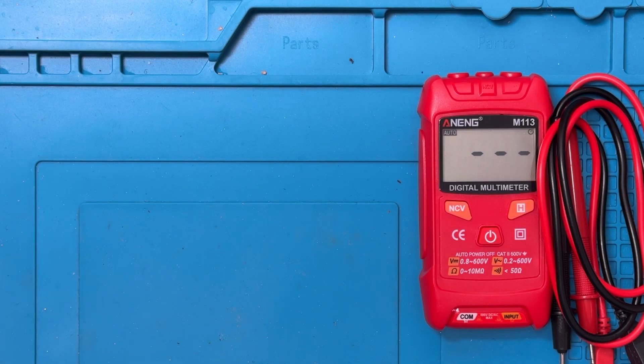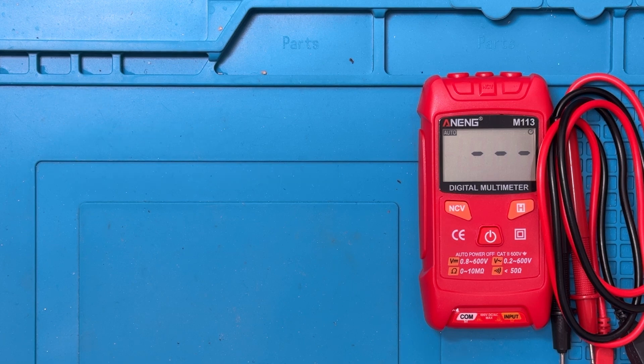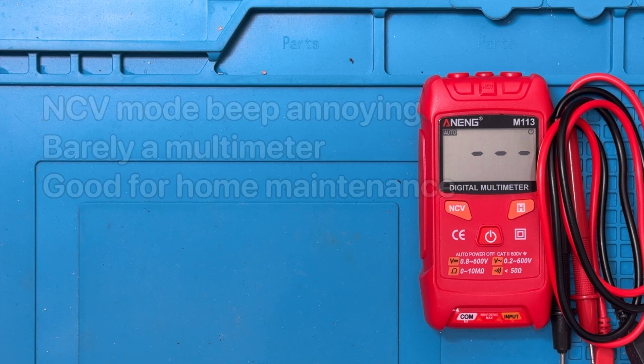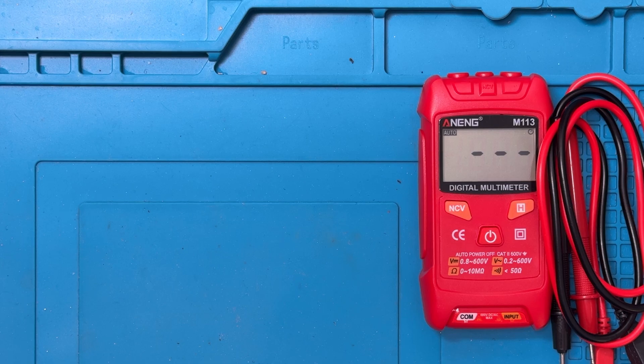In summary, this is a decent device, albeit with fairly limited functionality. The accuracy is good for the functions that it does have. Continuity is slow, and there's no dedicated continuity mode that would likely speed it up. Non-contact voltage is acceptable, but constant beeping in non-contact voltage mode is very annoying. For troubleshooting around the house, this would probably be a perfectly fine meter — its small size means it would be easy to carry around in a toolbox. Anyone serious about electronics would be disappointed by the lack of other measurements common these days, such as AC and DC current, capacitance, and diode check. There's no internal protection, not even a fuse, so you'll need to be cautious when using it in a high-voltage setting. If you found this video helpful, please give it a thumbs up and subscribe to the channel. Thanks for watching, and until next time!